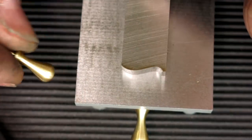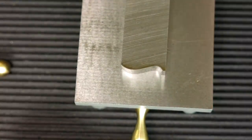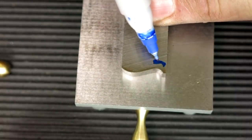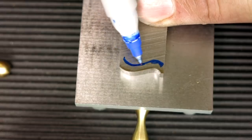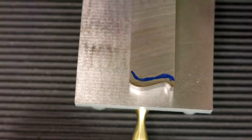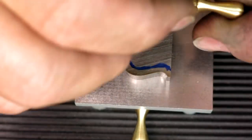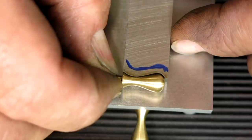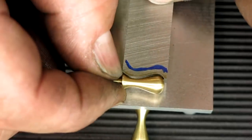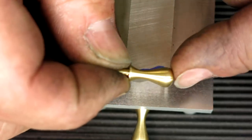There's the profile that we're cutting there, and all I did was literally sketch on the top of the tool with a Sharpie like that until I was happy with the shape of it, and then I went over to the bench grinder and ground that form there. You can see that it matches it, which it should, and you know you can produce multiples pretty quickly. Anyway, this is a great way to produce a small form like this.